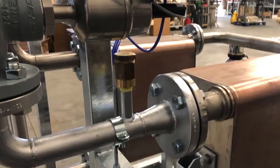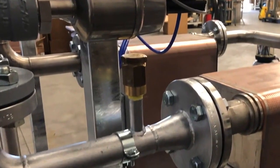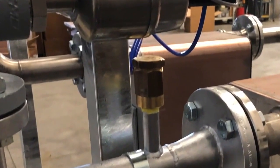When the steam flow ends, the vacuum breaker valve opens, allowing air to enter and completely drain the heat exchanger, causing the water and condensate to exit through the condensate drain. It is a good solution for efficient condensate management.